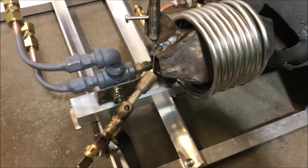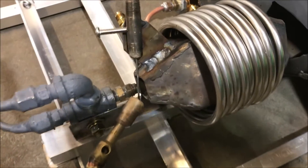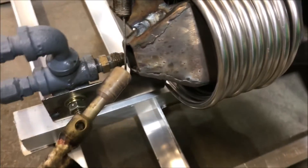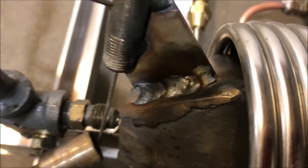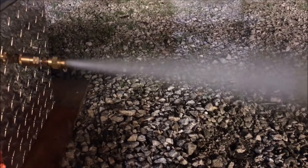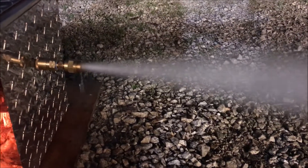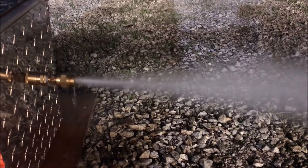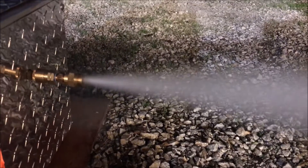What we're looking at is a triangular combustion chamber, and that allows the combustion chamber to stay glowing red hot even though it's encased in a cold water pipe — because we want that combustor to maintain that heat and it allows infrared radiation to pass the energy along. It's a little bit more efficient. It helps the combustor stay at optimum combustion rates, and it burns the fuel so much better when it's glowing that hot. So I prefer to keep them running like that, and it gives us a soot-free energy transfer as far as thermal transfer.